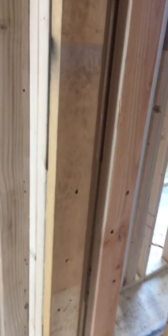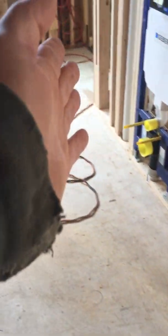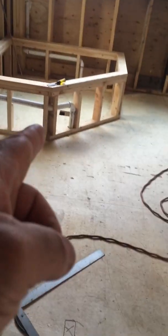We don't want to make a lot of sound. We're going to be doing a few drains downstairs too because it's an in-law suite — kind of separate from us. We've got a shower here, a two-inch drain running there, a three-inch toilet drain running there, and then the space below is another half bath and a kitchen. The last thing they're gonna want to hear is our plumbing.